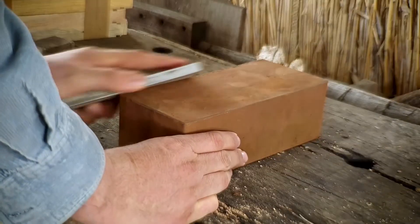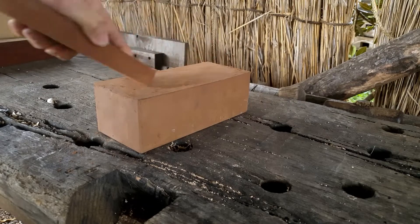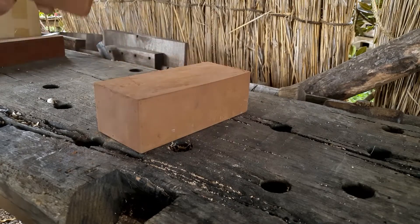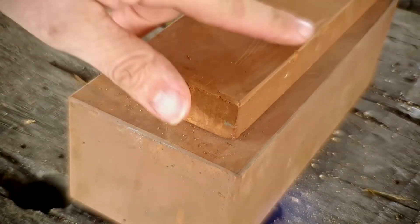Doing this can make your stones look a little bit ragged. It doesn't really affect the performance, but it's really not good technique. There's a simple fix — all you've got to do is add the chamfer. If you're using a diamond plate to flatten your stones, just take the diamond plate and rub off the corners of the stone. If you're using the three-stone flattening process, take one of the stones and instead of rubbing the faces together, rub the corner on one of the other faces, and that puts a little chamfer on it. It just takes off that sharp corner, which means that as an edge passes across the edge of the stone, there's that little bit of relief which preserves the stone edge and prevents it from chipping.